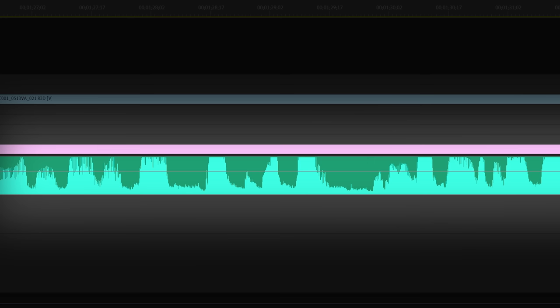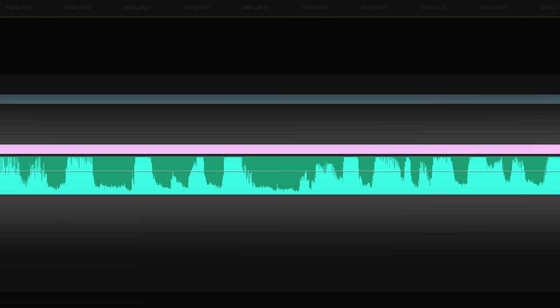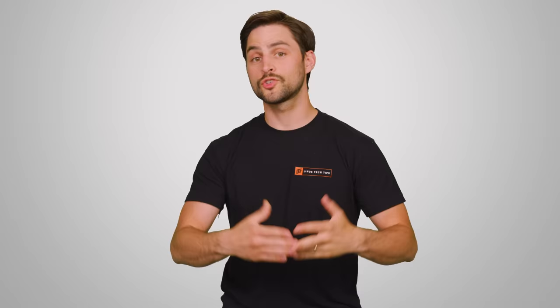The reason it's called clipping is that if you plug your setup into an oscilloscope, you can see the signals that have a high amplitude — meaning that they require a lot of power — are clipped off. The result is that the waveform will be flat on top because the high-power signals couldn't be amplified enough. So in place of the higher-power portions of the audio track, you instead get distortions and crackling since the actual signal isn't reaching your speakers as intended.